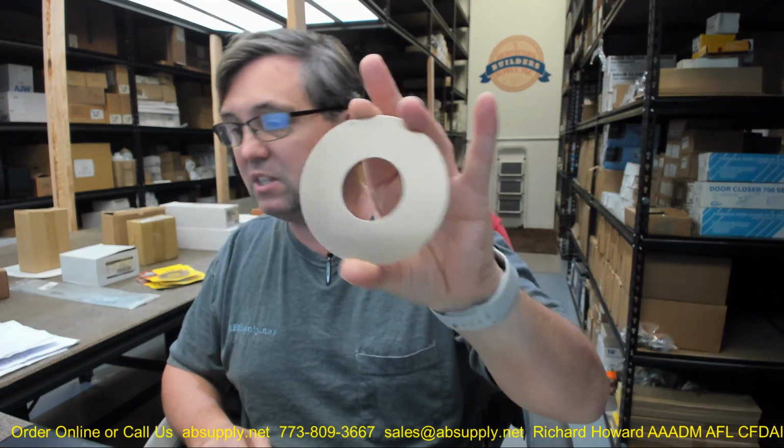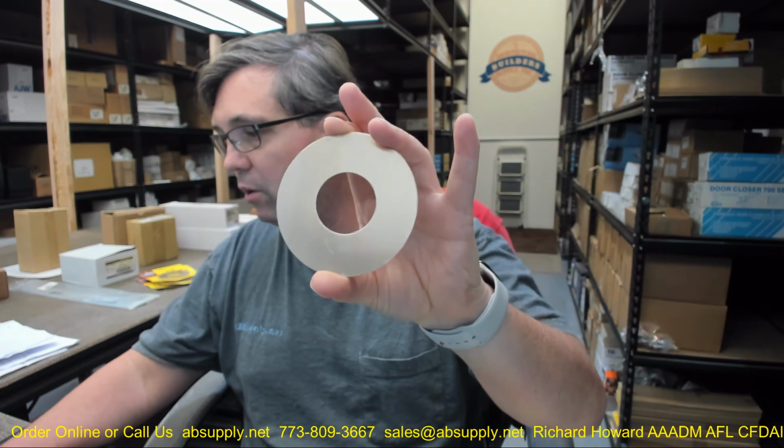This is the DSP-135. That means this plate. There is a link below this video to a document called Template, and that will show you the dimensional properties I've already pointed out. Says that the thickness is .032. My caliper is telling me that it's .046, but that's probably because the end of that's slightly flared out where they've cut that material.